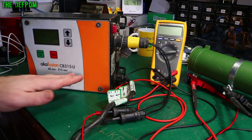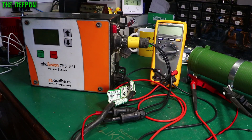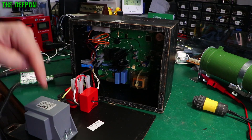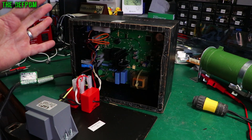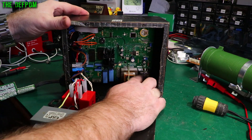I need to pull it apart and take the circuit board out to find out, but I could check power at the voltage regulators first - that will definitely confirm it either way. I actually reverse-engineered most of the circuit board last time and drew my own circuit diagrams, so I have notes to refer to. The transformer I was thinking of is on the output side as a filter, not the mains input, so that loose connection wouldn't cause no-power. Here are the two transformers - the smaller one was okay last time, this larger one is the one that failed. The cable tie isn't even tight, so the transformer has probably dislodged.